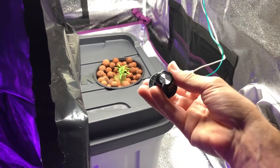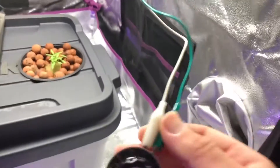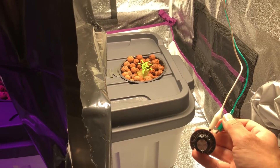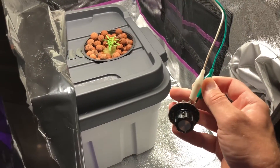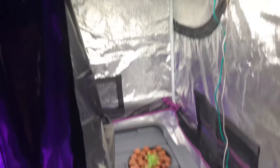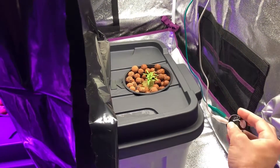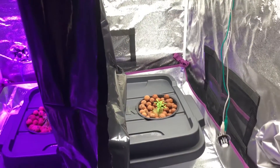I have this set to full power — all the way up. I've tried different combinations of wiring. Watch what happens when I disconnect this wire: you can see it gets a lot brighter — the camera is dimming it down but it's really, really bright. So even though it's set at full power, it's not working properly. When I reconnect it, you can see how the camera readjusts momentarily. I can dim it down to almost off and it works fine that way, but I can only get it up to maybe 50% of total output.